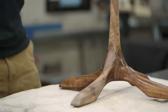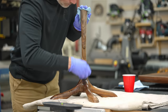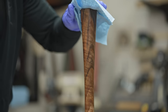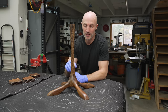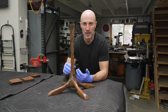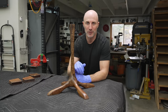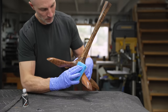The finish I'm using here is Rubio Monocoat, but what's different about this piece is I sanded all the way up to 600 grit. There's a fallacy out there that with hard wax oils like Rubio you can't sand higher than 180 grit — you definitely can, the Rubio will stick just fine. I have an additional step with N3 that will really bump the sheen up and give more protection. You can see we already have a really nice sheen on this walnut — one coat of Rubio, one coat of maintenance oil — and I want a little more contrast, so I'm going to keep building coats of N3.